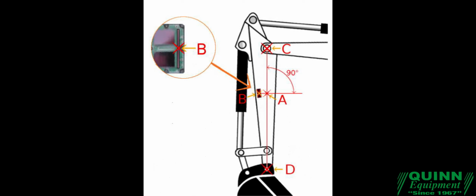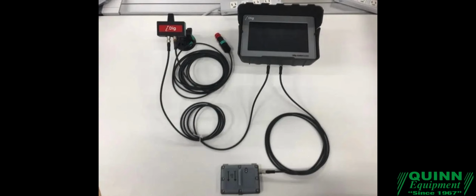Will not be subject to knocks or damage. Avoid areas where tools are commonly stored. On some machines, under the floor mats to the side of the operator's feet is the only location. Take care to make a safe place where the sensor and cable will not be affected.